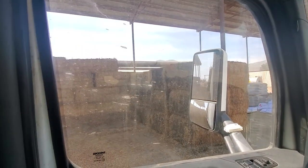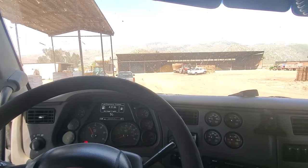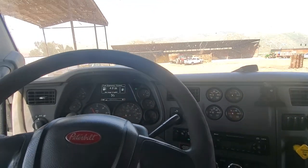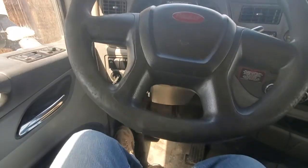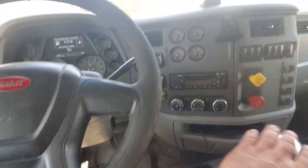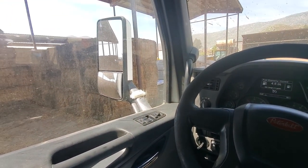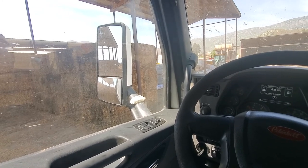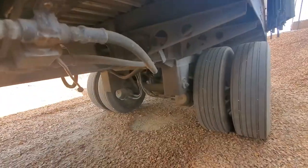The little heifers are just over here — I like to feed them for lunch anyway. So this is a walking floor trailer, pretty easy to operate. I'm all backed in, clutch goes down, engage the hydraulics right here with this little switch, slowly raise the clutch up till it engages, bump up the high idle, and I already got the doors open. I'll let you listen to the sounds of almond hulls coming out.